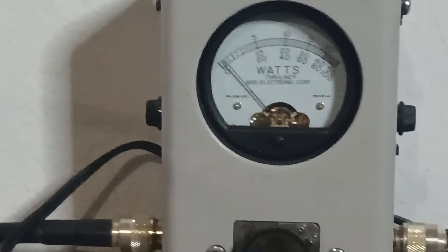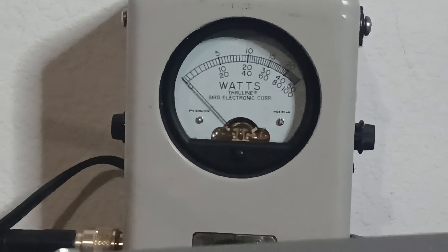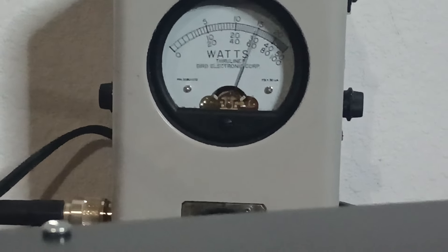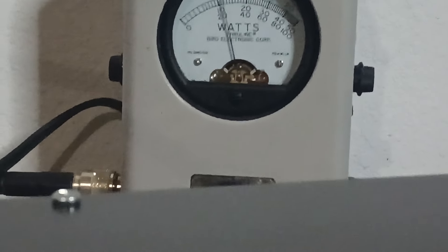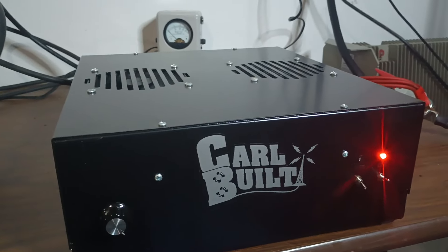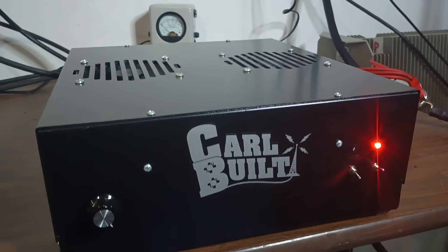Going to about 600 average. Again, we're only putting five watts average into it, so we're seeing 600 watts average out — that's not too bad. And 20 to 25 watts PEP going in — top scale — hello — audio — 1500 or so. So 20-25 in, 1500 PEP out — that's pretty damn good, honestly. If I had my little unit in out here, it'd probably drive it on up to 1600, 1700, maybe even 1800 watts PEP.